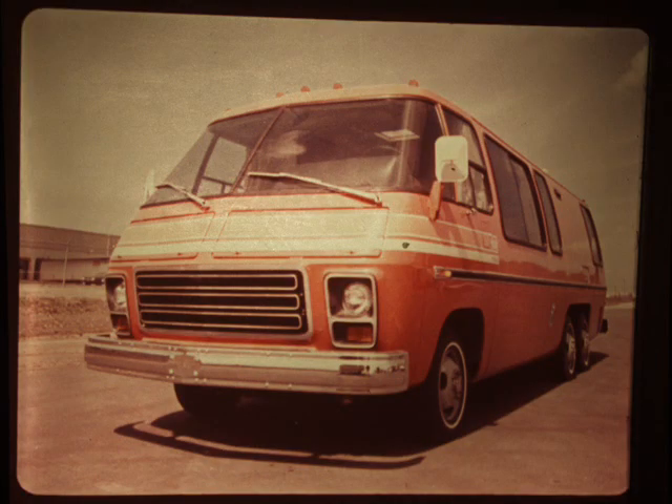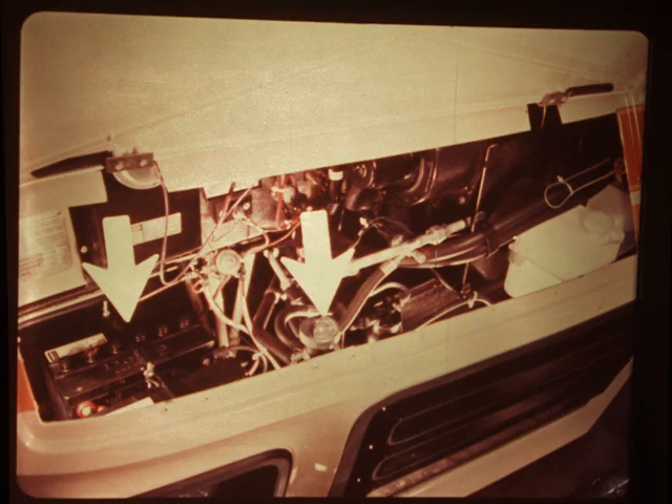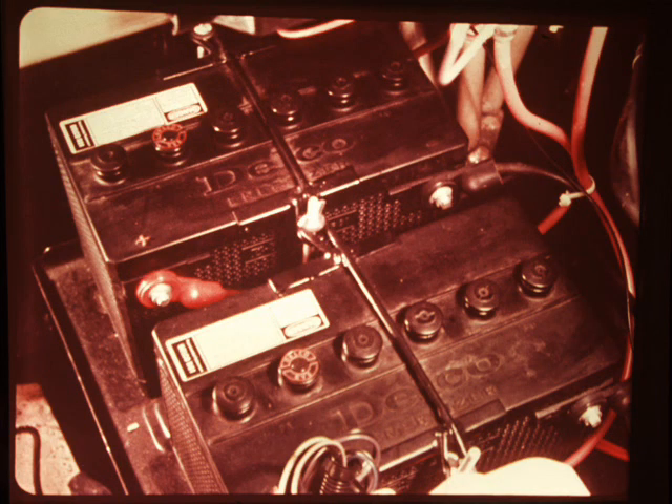Let's walk to the front and start our tour there. To open the engine access doors, turn each latch knob to the left. From the passenger side, you can check or fill the batteries and engine oil, the radiator, engine coolant reservoir, and the air conditioner receiver dehydrator sight glass. The Delco-I makes checking the battery level easier; however, a handheld mirror is required for a visual cap-off check of the rear battery. For battery removal, you must remove the front battery before the rear one.